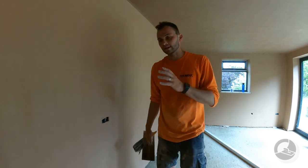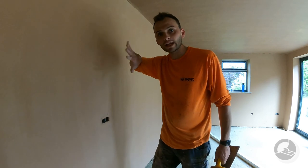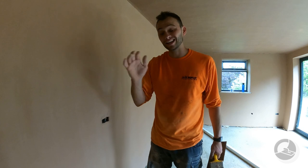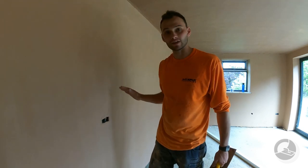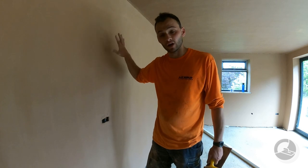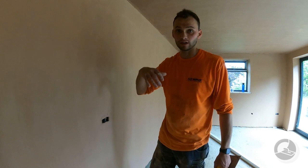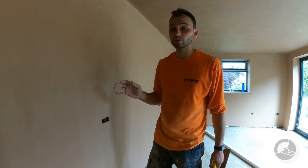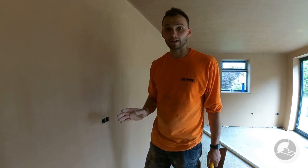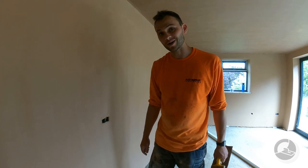That has now had just a bit of a dry pass just to really compress the plaster while it's still got a little bit of moisture in it. Then we're just going to leave it to go right off — pretty much so it's touch dry, or just before you would do a second wet trowel if you were not sponge floating it. Then all we're going to do is one wet trowel and then a dry pass with the plastic, and then that will be it.